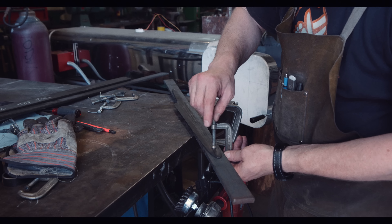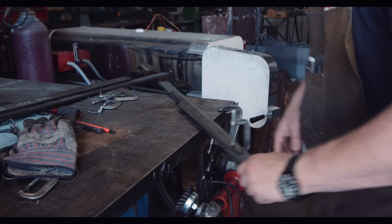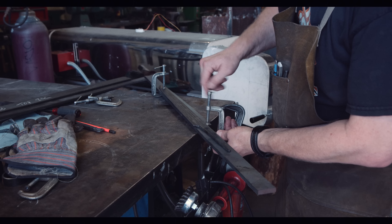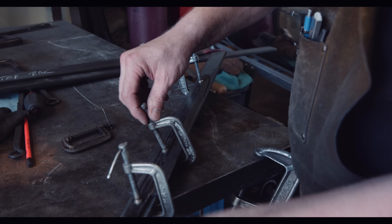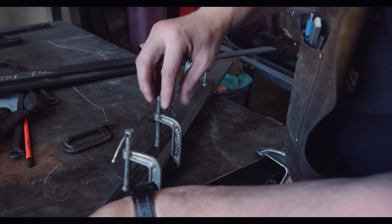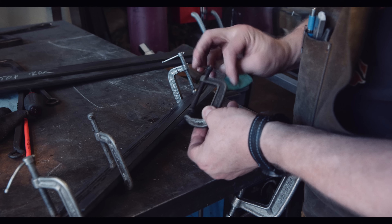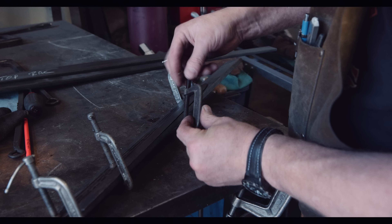The quenching process should have brought the blade to maximum hardness. Tempering reduces the hardness but increases toughness. Since the blade developed a slight bend, I clamp it to a thick rectangular bar of steel and hold the whole contraption at tempering temperatures for about 60 minutes. The final hardness is determined by the tempering temperature and is different for each steel. For swords, I usually temper around 600 Fahrenheit — that's 315 Celsius — and for knives usually somewhere around 400 Fahrenheit, which is 200 Celsius.